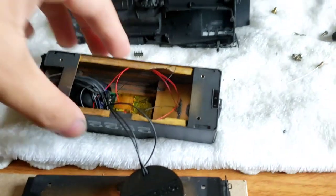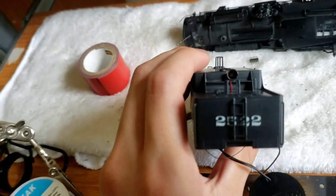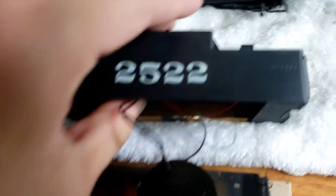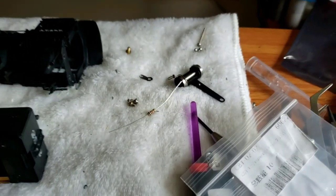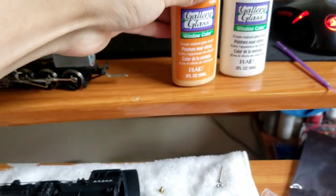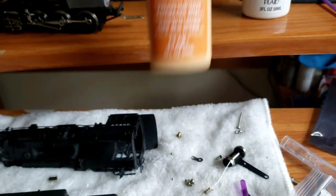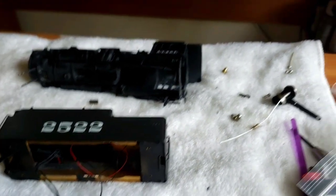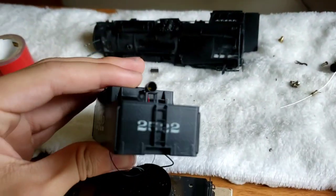You can see the LEDs wired — I have the LED right in there. You can see the tiny little LED inside there with the wires coming straight down. In order to mount the LEDs, I just used gallery glass clear. I first insulated the LEDs with this amber stuff — that makes sure the LED doesn't touch the inside of the brass headlight casing. And then afterwards I just used the clear gallery glass to glue it in, and it actually turns out pretty well.